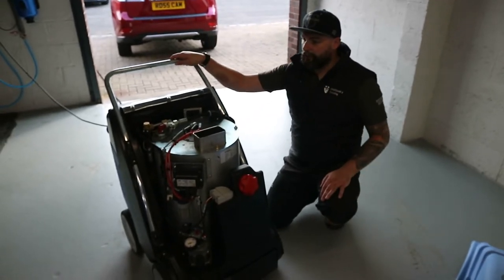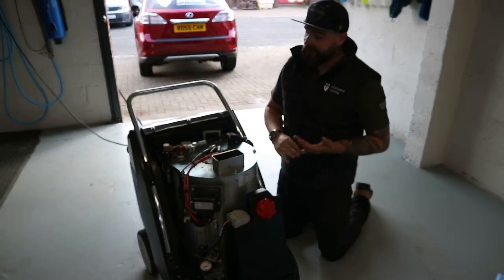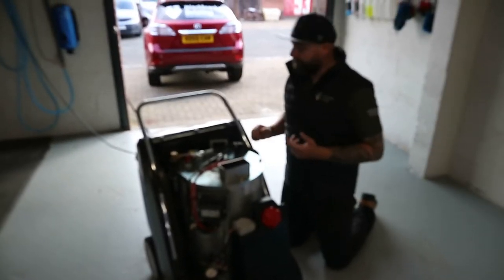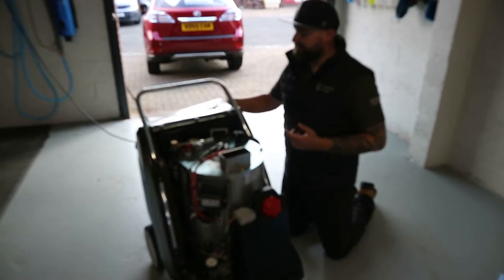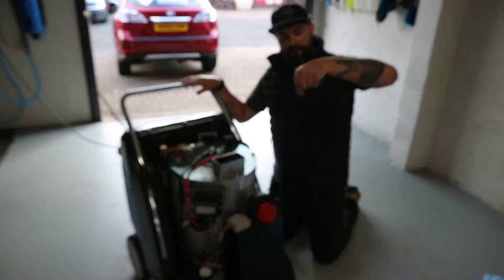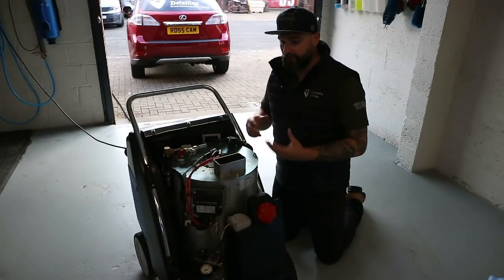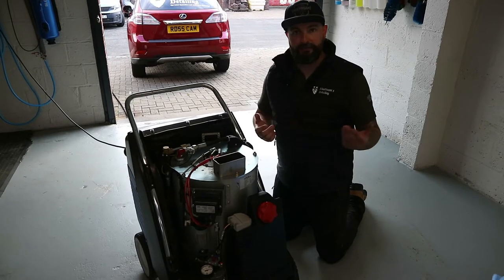So with the help of a gas engineer who works at the unit dead opposite me, we removed this top plate and there's a couple of little screw, almost kind of thumb screw fuses, and one of them was loose. It turned out when it was operating, it was shaking, it was actually coming out.